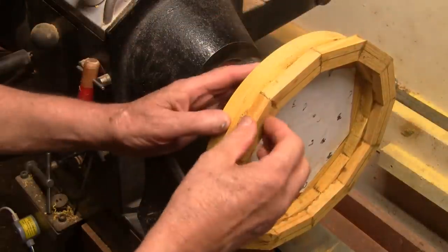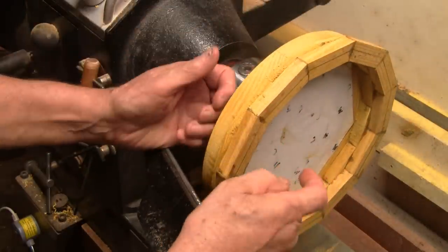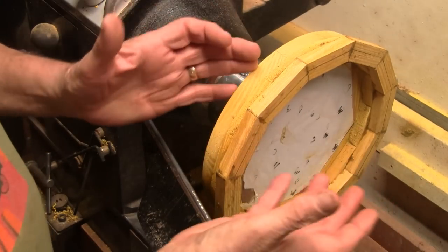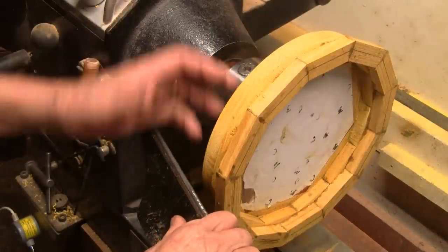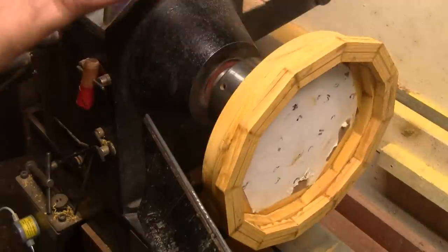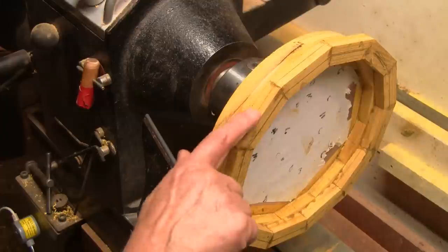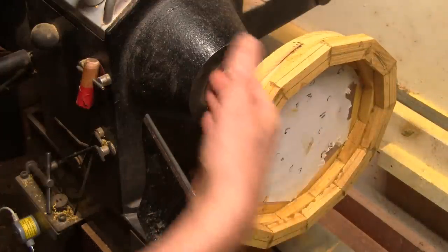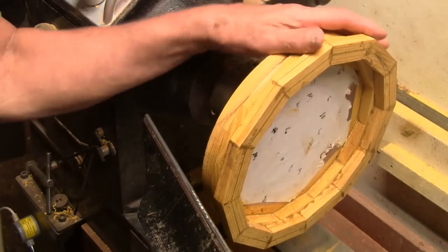This is all that I'll be gluing on here. I could put a walnut ring on, it would probably look good, but I don't want to break up the orange. In my mind that illusion is going to be floating in an all-orange surface and I want to keep it that way. It's going to sort of be a Thanksgiving-type platter, and I'll probably actually use it - maybe put cookies in it. I just have to round this ring up, taper it, blend it in, and then do the inside. I'm going to use my half-inch bowl gouge at about 750 RPM.